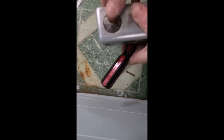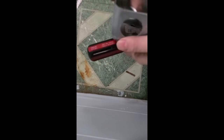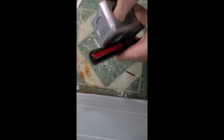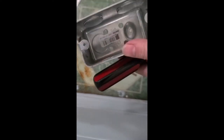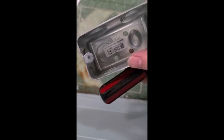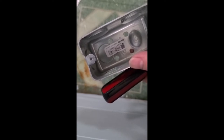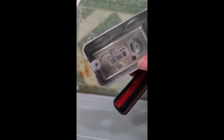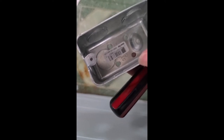And that's pretty much where I am right now, from trying to figure out what I want to do and changing my mind over and over and over again, it ends up being a problem. What I'm going to do with this one is I am going to bring the wires that are currently going over the sink, and I'm going to tie into that same circuit so that I can put this outlet in line with that circuit so that there's a place to plug in the refrigerator back there.